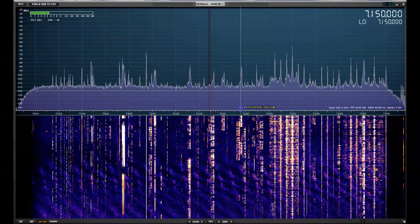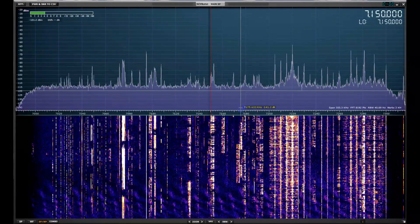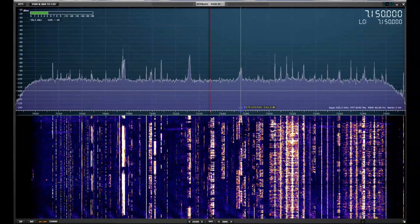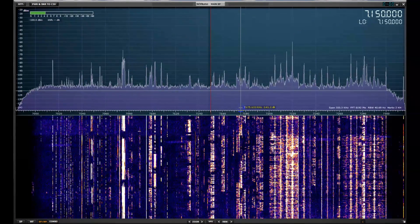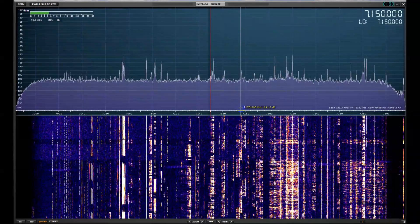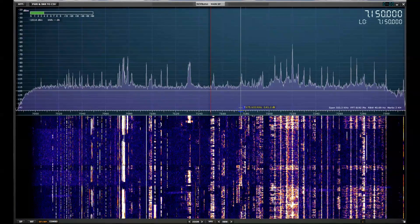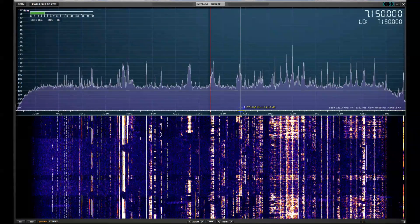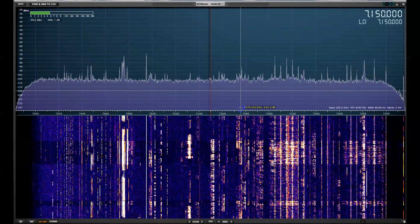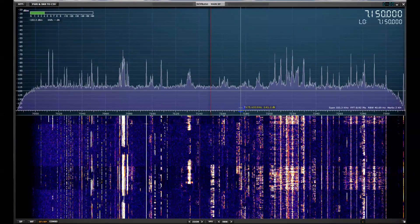We're looking at a very active 40-meter band right now, and we are on the STEP-IR big IR vertical. Now I'm going to turn to the dipole. With the dipole, you'll note that the noise level goes up. Here's STEP-IR, dipole. But now look at the signals as they stick above the noise on the top half of the screen. If I turn to the STEP-IR, we get greater signal-to-noise ratio and less overall noise than we do on the dipole. The dipole isn't very high — it's only about 21 feet in the air — and yet it does receive very well, as you can see. But the STEP-IR seems to have an advantage.